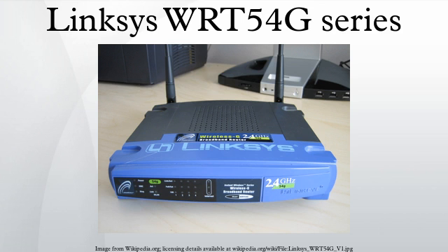The V2 model has an additional two USB ports for 3G modem use and one other USB port which has yet to be put to use. To use this router with other cellular providers, one must use an alternative firmware provider. The stock firmware does not support other cellular providers, even if one has the exact supported air card — for example, TELUS Mobility uses the Sierra Wireless Air Card 595 which is supported by this router, but because it is from TELUS Mobility and not from Sprint, it will never load. This is only true for the Sprint and AT&T branded models.